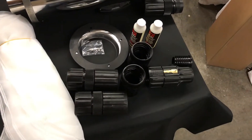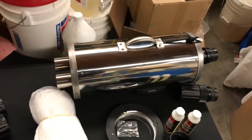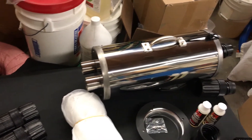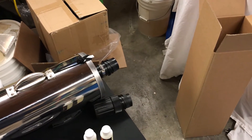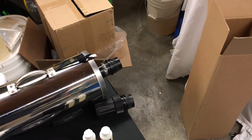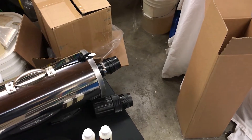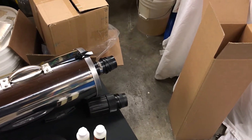$60 gets you enough cool cuffs to do 200 feet of hose. You can see he's starting with his silver bullet — dual 2-inch ports on the back, 2-inch on the front. One of the parts that comes with the starter kit is the starter cuff, which is a male 2-inch, comes with a clamp. You would slide that on the front of the silver bullet and clamp it down. Now you're following the fireman's rule, which says all the males point towards the job.